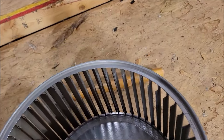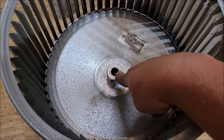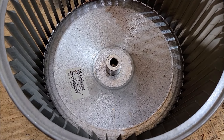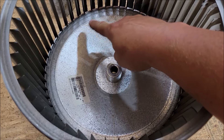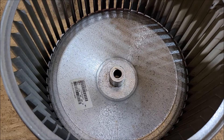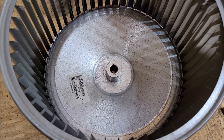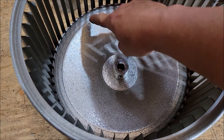I don't even know why I checked this because I've never run into this problem before - I'm going to show you something. Put down in the comments what's wrong. Does that supposed to happen? No it doesn't. So what has happened here is - however they go about putting these on, it doesn't look like it's ever welded, it looks like it's almost crimped - they come in and bend little tabs where these blades are to keep this main wheel from spinning inside of the fan housing. These little blades are supposed to spin really fast, suck air in, and that's how all this works.